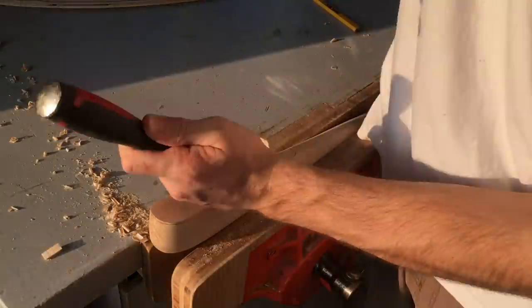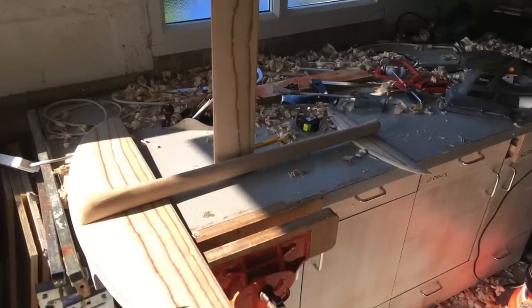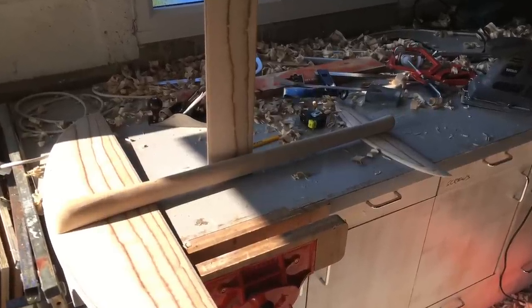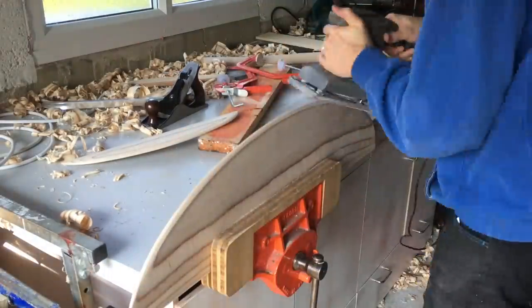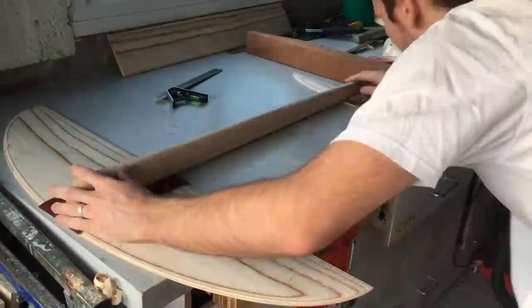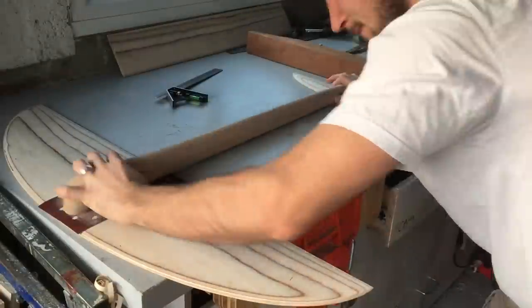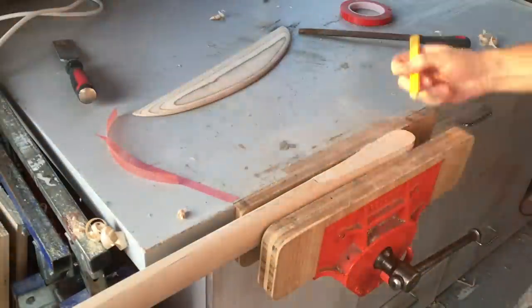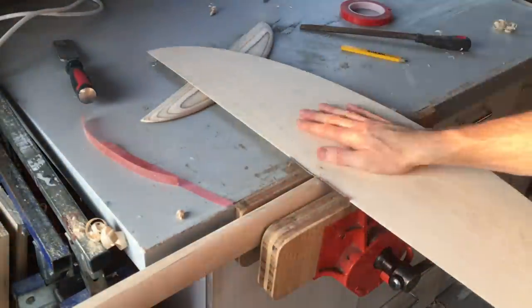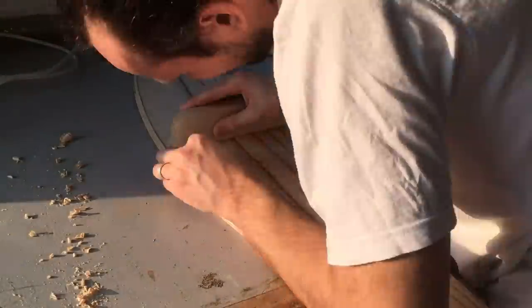The axe handle I was using was actually incredibly dense. It's such a nice piece of wood to work with. I was able to carve it out with a chisel and get a near perfect profile of the wing, but I knew that this area of contact had to be absolutely spot on, so in the end I sanded it, and you can see me here, I'm just moving it up and down just to make sure there's no air gap. So when I bond it with the mixed up fiberglass and epoxy resin and I push it together, there's no air void, so I've got maximum strength.